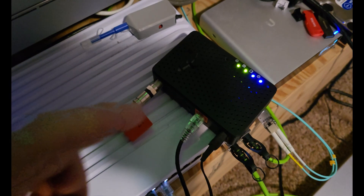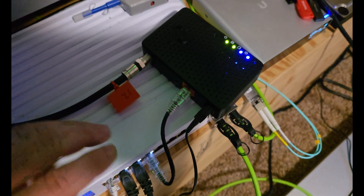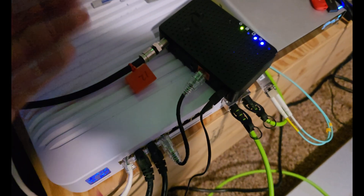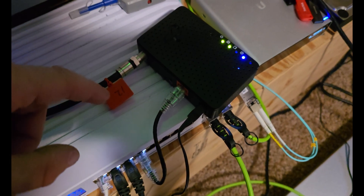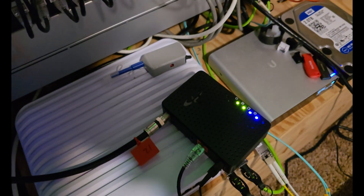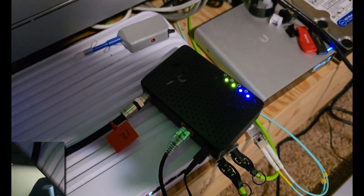Here's the other end — blue means it's linked at 2.5 gigabits per second. So you just hook up your coax and hook up your Ethernet. This is a 2.5 gig switch, so if you get the 2.5 gig model, just make sure your switch can do 2.5 gig. I labeled mine — I'll link the cable tags in the description if you want to label yours. And I'll make sure to link the coax identifier in the description too. It's just that easy to get Ethernet over coax.